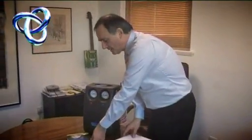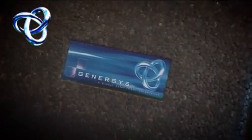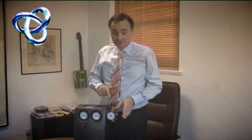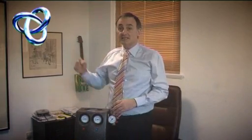Now, that's what you'll see in your home if you have a Genesis solar system fitted — three dials. This dial is a pressure dial and will show you the pressure of the heat circuit, normally maintained at three and a half to four bars. If you see a big pressure drop, it means the system hasn't been installed properly or there's a small leak somewhere. If you watch the dials after your system's been installed, you will see big fluctuations in pressure as heat is moved from the panels into your cylinder.